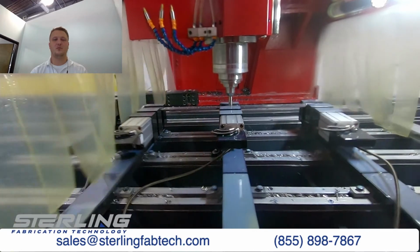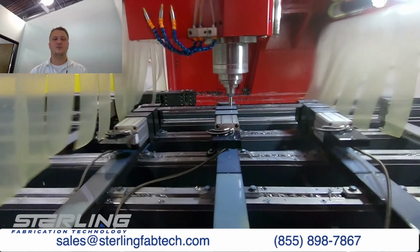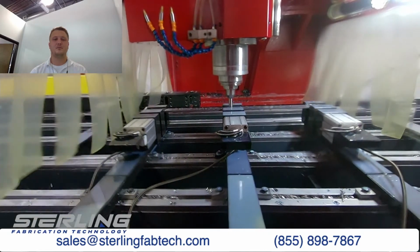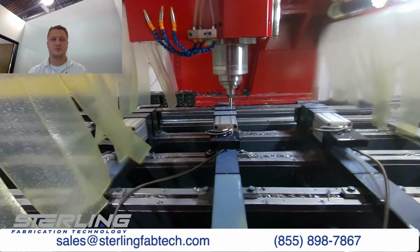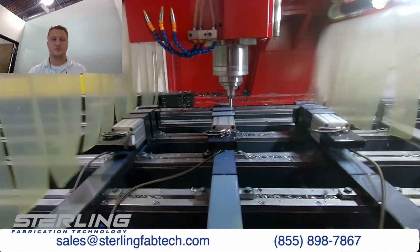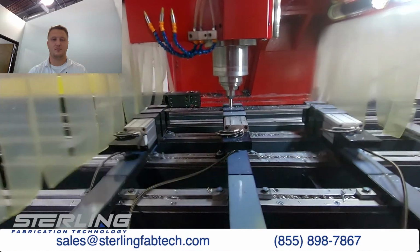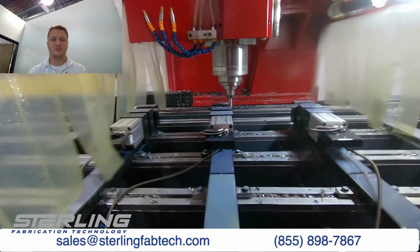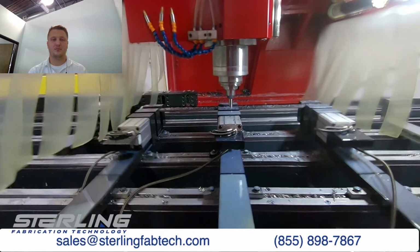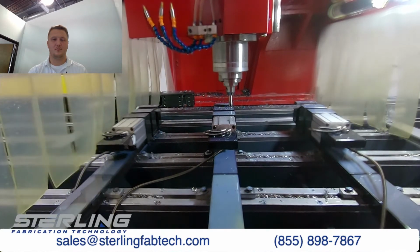And I'm sure it's kind of hard to tell for those of you that are watching, but the feeds and speeds that I'm running with this tool, I'm running at 3,050 RPM at 360 inches per minute. So very, very fast, but like I said, I'm taking very light cuts. I did a contour ramp on that slot there, but I only ramped down about 20 thousandths per pass. But that's what those tools are meant for. It's very light cut, and it's very, very fast.